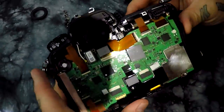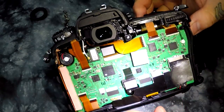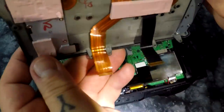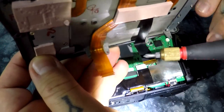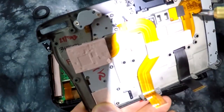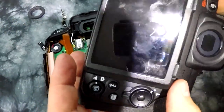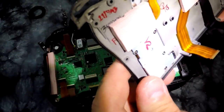This is the main board of the D500. Underneath here on the other side is the processor. I'm going to disconnect these cables. I've disconnected from the main board the button feed. This one feeds the LCD display — it's a 12-contact LCD display. And these feed the control of all the buttons. You can see it goes up here and branches off into a Y because we have all the buttons over here, and then the buttons and controls over here including the rocker joystick. So we have two flexi cable feeds. This is the back of the D500.